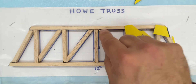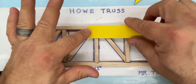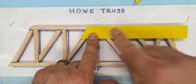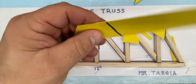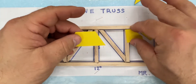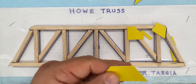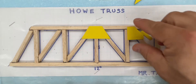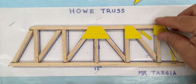There's one more joint I want to show you — the one in the middle here. You can use the angle already created on this side and just create another line coming out this way. Cut that with the scissors and check it for size, because you can always trim them down. It was just a little bit long, so I'll trim it down a little more. Now I have a perfect fit, and you can see how the gussets are going to be assembled and placed.